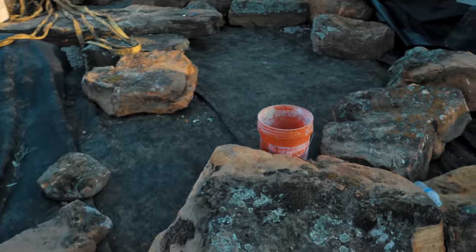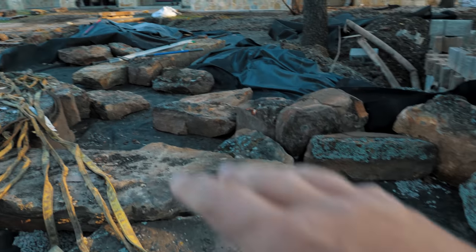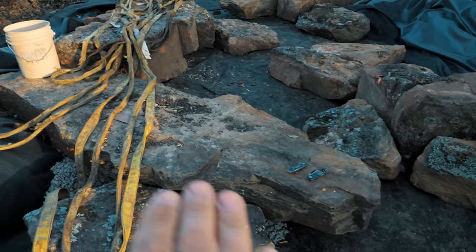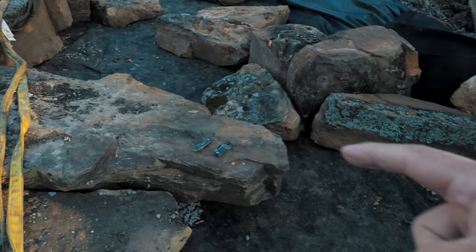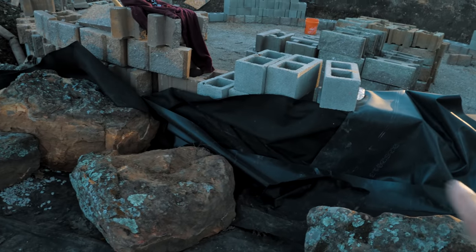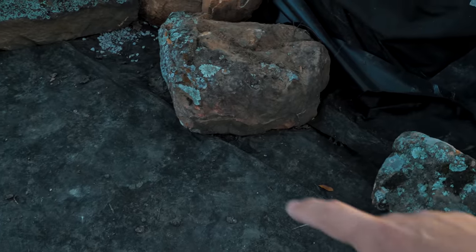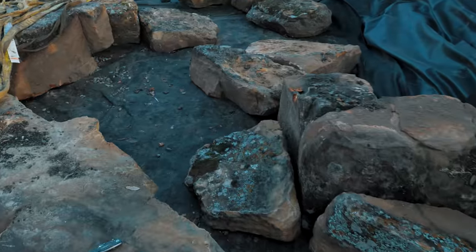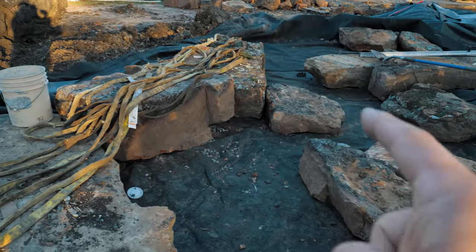When we're building streams and waterfalls we're always thinking in reverse, because we're building from the bottom up to the top, so you always have to imagine how the water's going to flow down. When placing rocks in the stream, especially a big stream like this, you always think about how the water comes through and what's going to make it move. We've got this really long stone here, about 10 feet long — the water's going to hit here and it's going to be forced out into the stream, making its way into this eddy by the wall for the fireplace.